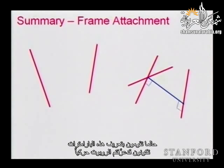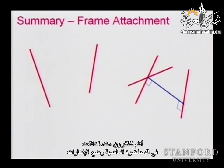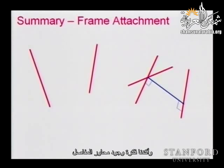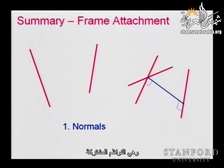Once you define these parameters, you define your robot kinematics. You need to add the masses and inertias, and then we have all the models. You remember last time I discussed the attachment of frames, and we emphasized the fact that the axes of the joints are going to play an important role, because those axes provide us with information about the distance between axes — the common normals.